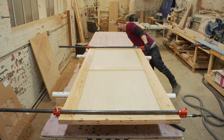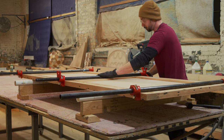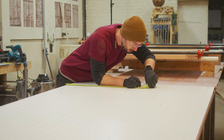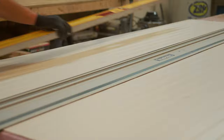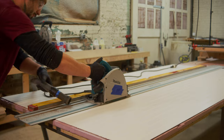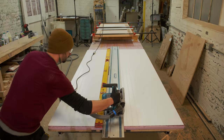For each door, we want to use three clamps so we can have even pressure on each rail. Make sure you're not using too much pressure when clamping, because you don't want to flex the door out of shape. Now we're going to add some wainscoting to the main panels of the doors — that was a special request from my mom so it would complement the aesthetics of the Airbnb. The same caution against excessive force during dry fitting applies when gluing and clamping up the barn door.